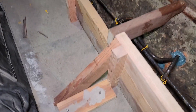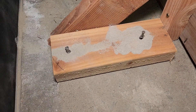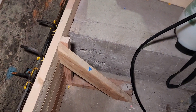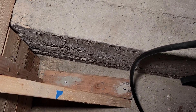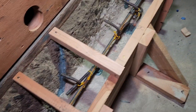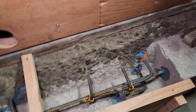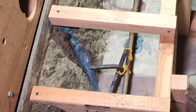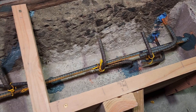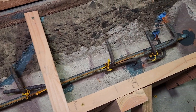Here's the footing I set up for the 45-degree support-side angle that supports this. I used duplex nails with 12-gauge coated wire and a quarter-inch masonry bit to drill into the concrete, put the wire in, and nail the duplex nail through the board — that keeps it really solid. Getting up towards the existing cement, there's the crack that got epoxied. We're rebarred and epoxied into the existing cement addition and into the house's foundation, and the pour is going to tie all that together.